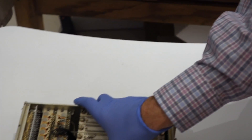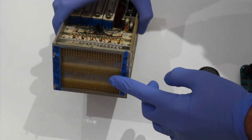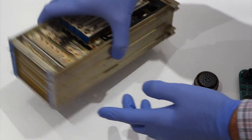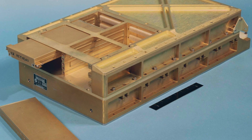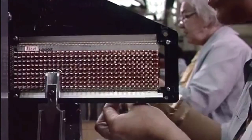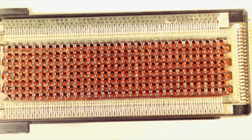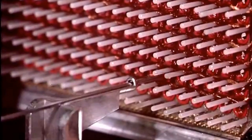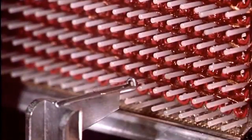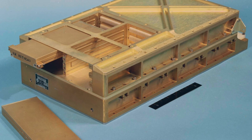Ken has some updates on his rope emulator project. This is one of the two rope emulator boxes that Raytheon built in 1970. Core ropes are the equivalent of ROM, where the program used to reside. Here you can see a rope module being woven at Raytheon — wires would go in or around the ferrite core to make a one or a zero, a tedious process obviously.